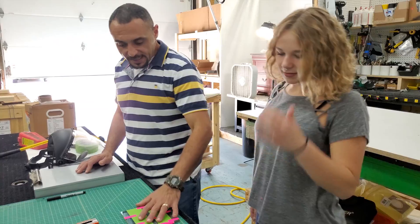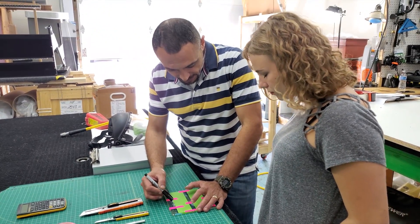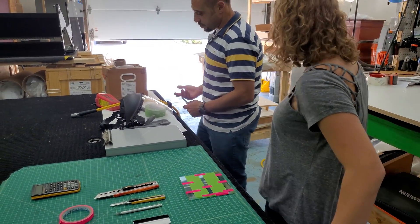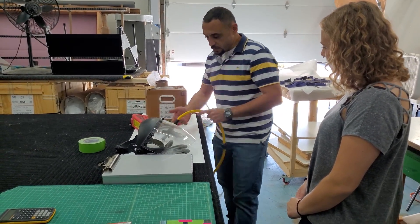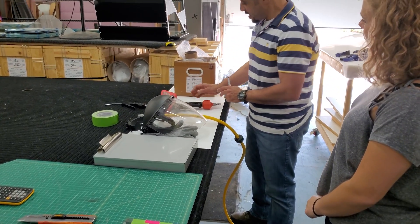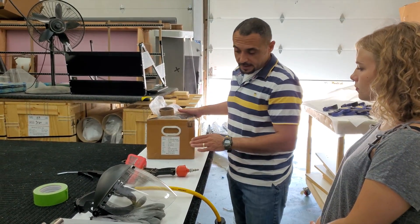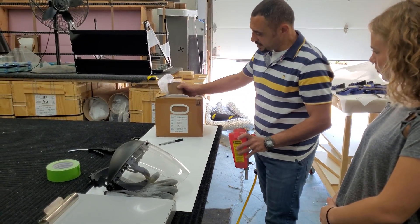After you finish all the masking and decide on your design, you need to make sure that the areas you want sandblasted are left naked — no masking tape over them. The areas where you want the mirror to show are the ones you cover. You're going to need gloves, a foam face mask, a source of air pressure of at least three gallons, and a gun specialized for sandblasting. We tried all the materials and the only one that works for removing the mirror layer is aluminum oxide — there's nothing else.